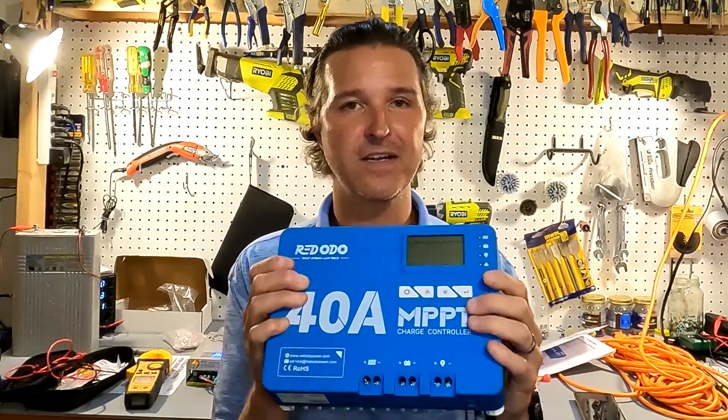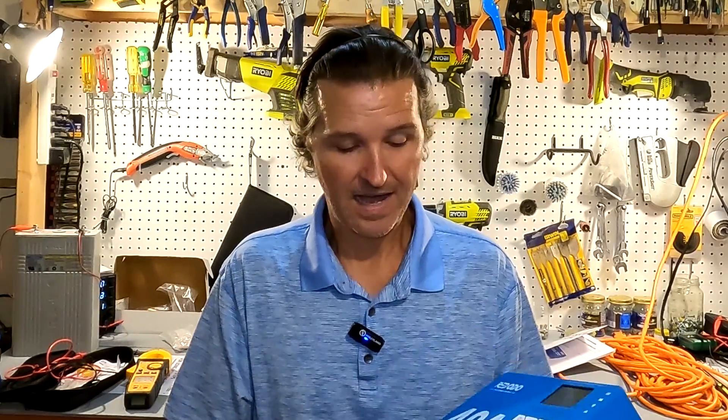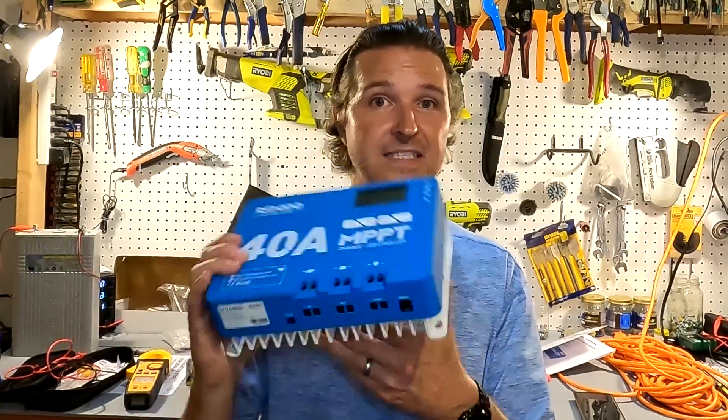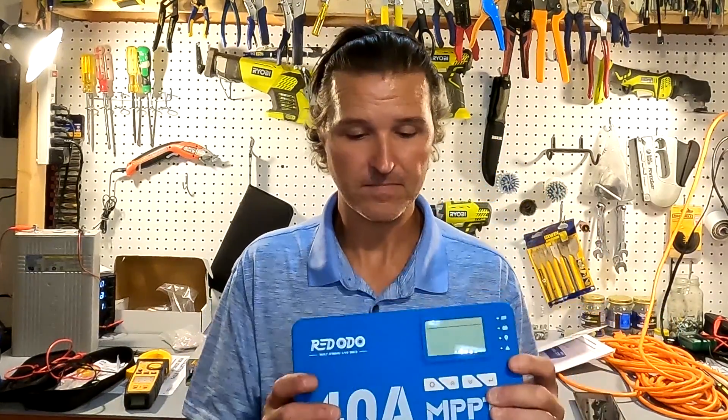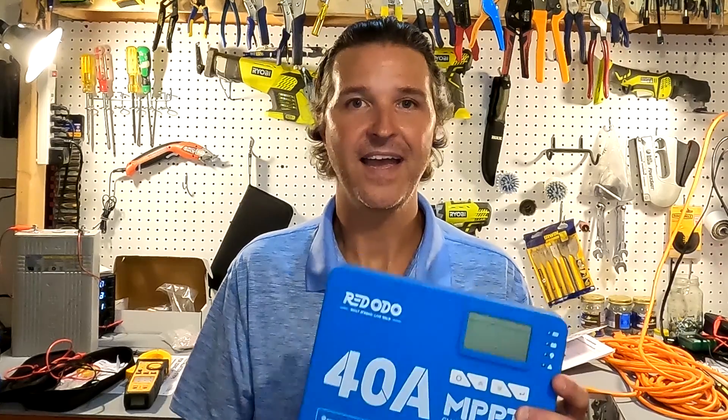The design is great. I like the rubber powder coating with the nice white heat sink — the branding is really good. The display numbers were spot on when tested against my multimeter. The connections on the bottom easily support six gauge wire, which is appropriate for a 40 amp controller. This supports 600 watts of solar at 12 volts and 1200 watts at 24 volts, and it's 99.9% efficient. I'd say this is a pretty good bang for your buck. Please leave any questions or comments below and I'll be sure to answer them — thank you for watching, have a great day!